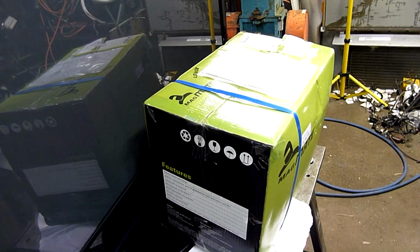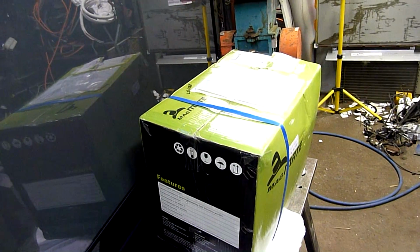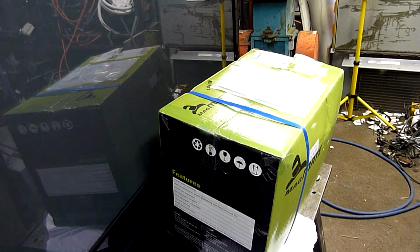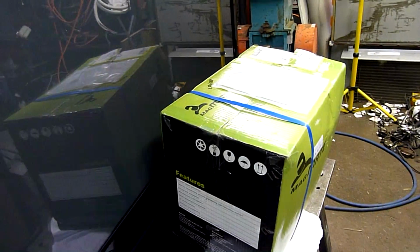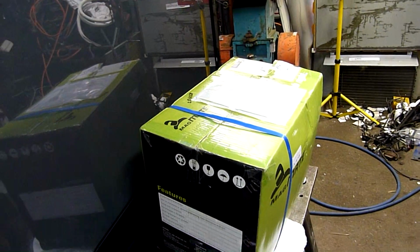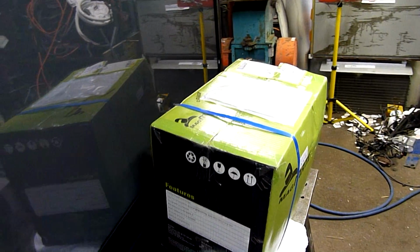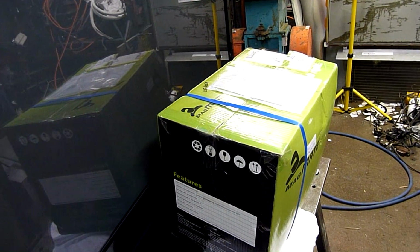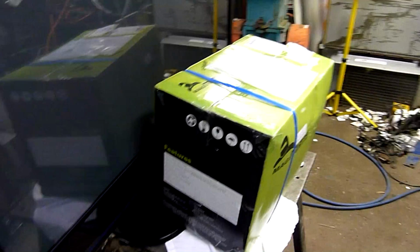I've got to get the gas account started tomorrow and pick up a gas bottle as soon as the account's active and ready to go. I'll probably also pick up maybe a second bottle for just purging, blow gas through stainless steel tubing and things like that, so it doesn't oxidize on the inside. It's back purging, I guess you call it, particularly for the jet engine combustor. I want to back purge that whole thing and have no excess burnt stainless steel on the inside to flake off and go through the turbine.